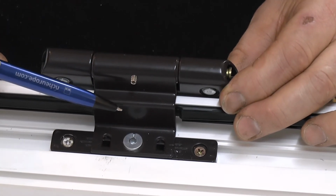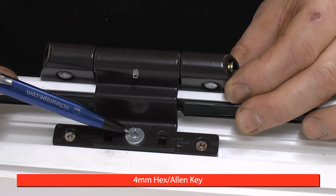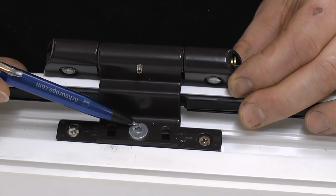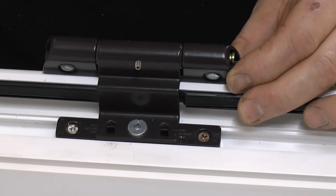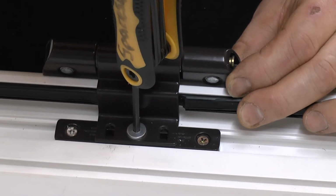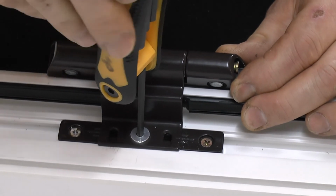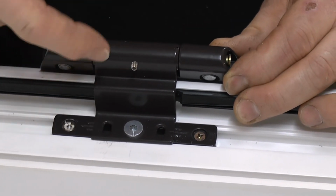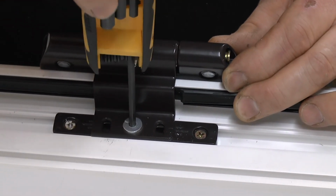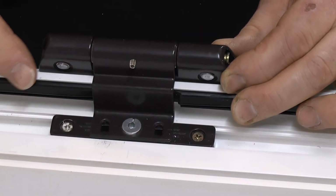In order to achieve your final adjustments, minor adjustments on the door, there's the Allen key adjuster here, and you can see there's a small cut on this side. That allows you to identify just how far you've turned this screw, and by offering the Allen key in there and turning it through 180 degrees, that pushes this plate forward. That allows the adjustment. Now if you continue to turn it right through 360 degrees back to where it was before, the plate will be almost flush.